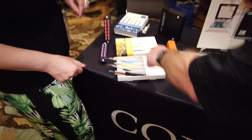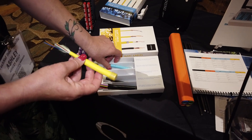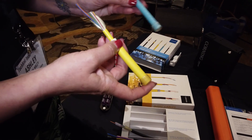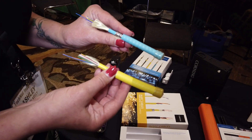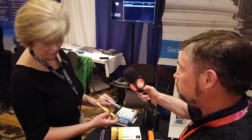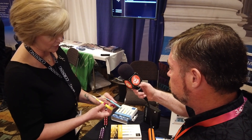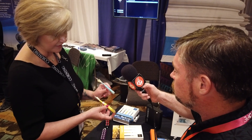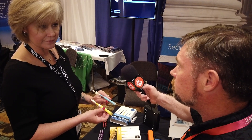You've also got a couple of internal cables — could you tell us about both of these? We have two variations of an inside plant cable. The standard industry color for single-mode is yellow, and the standard industry color for 50-micron OM3 or OM4 is aqua. We have two different armor options here: a dielectric armor and a corrugated steel armor. The corrugated steel has more crush resistance, but the dielectric armor is very lightweight and can hang on J-hooks.